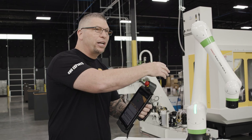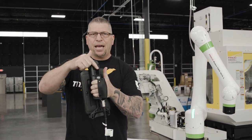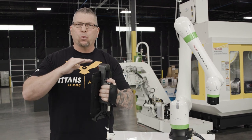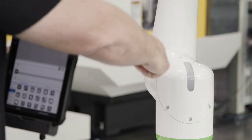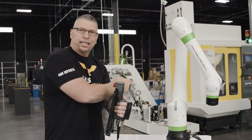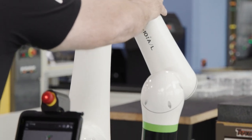If I want to go to another point, I'm simply going to move the robot and I'm going to hit that point. So let's do just that, all right? Dead man switch right here. Press it all the way down and that's emergency stop. Stops everything, right? Press it halfway and it goes into a mode that allows you to move the robot, all right? See that blinking light? I lift my thumb off. It's solid green. I go halfway down, it's blinking, and because it's blinking, I can now simply, watch it now, I can move the robot,